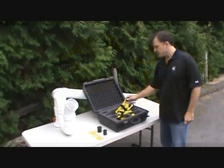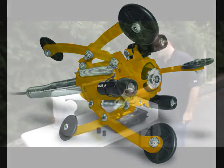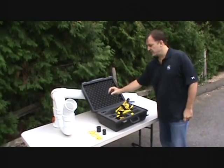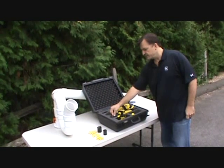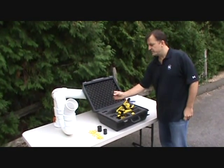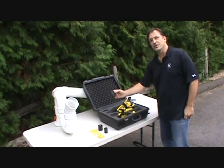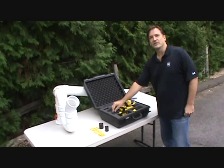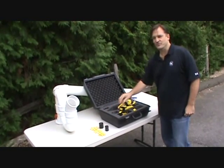We have our large roller skid for 6 to 12 inch lines, which also provides mounting for some auxiliary lighting when you're in larger lines, and includes a set of larger wheels for larger pipelines and if you have large gaps or transitions in your pipelines.